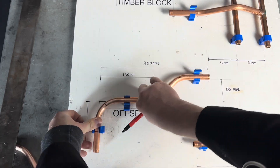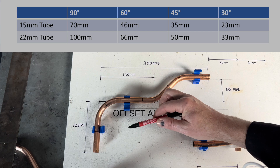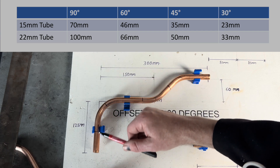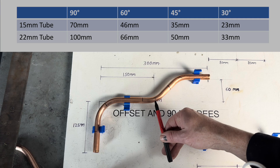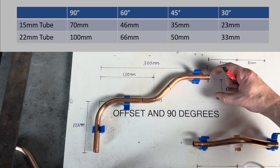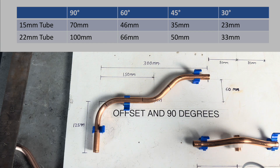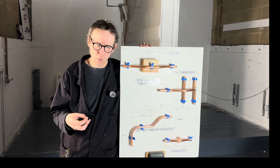Let's put our work into the jig and have a look. Good fit. So let's look at what we've done. The first bend was the 90 — we wanted the distance from the middle to the bottom to be 125mm, so we measured back 70mm and that line was touching the start of the former. The second bend: we wanted the middle of the 45 degree bend to be 150mm, so we measured back 35mm and that line was at the start of the former. Then once we worked out the 60mm height, we measured back 35mm again to the start of the former. So that's just another way of doing this exercise. I've shown you two different ways of doing this bend — what way would you do it?